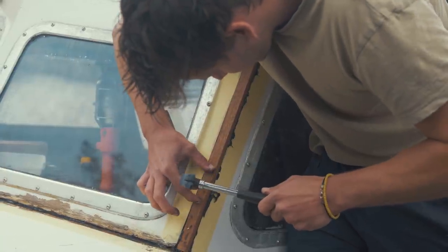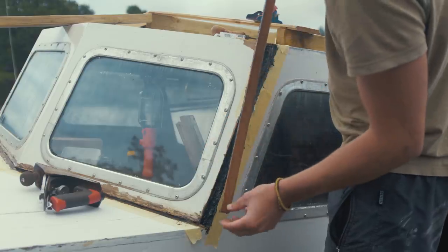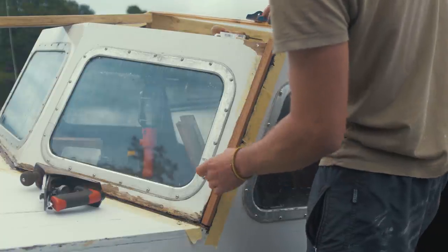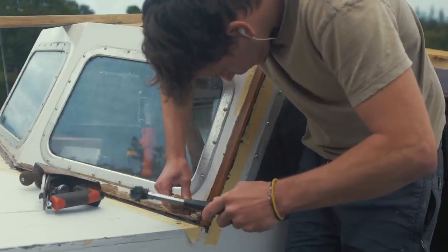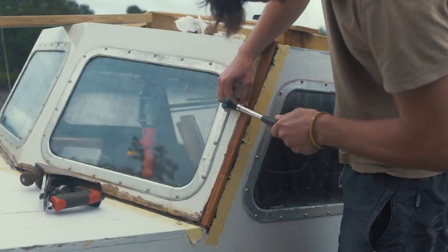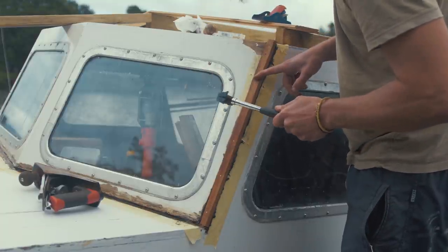I just hope that I put plenty of varnish afterwards into the hole, because I don't want moisture to get in. The ones up at the bow look like there's some sort of reaction, which I can't explain. Either that or water got in and they started rusting, because there's some sort of black showing through the varnish and it's spreading through the wood. It just doesn't make sense. But let's get to that next.